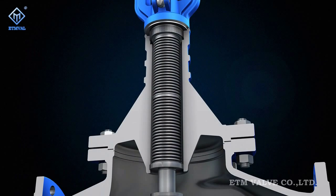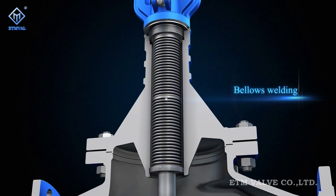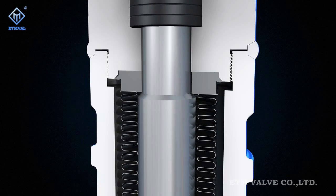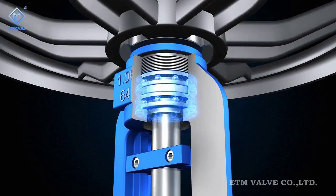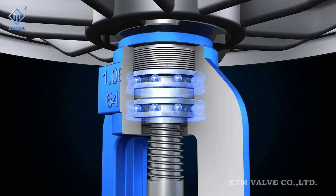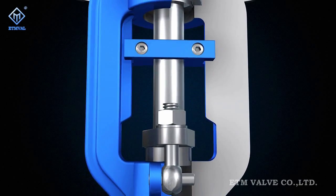3. As a standard configuration, all Figure L series products are completed with triple security sealing, including: 1. bellows welding, 2. two-stage back seal, and 3. packing gland with ball locking device at the bonnet. 4. All Figure L series products are designed with two thrust ball bearings and a stem nut to reduce the valve opening and closing torque.